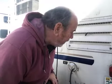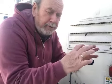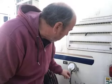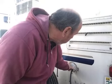This is a little awkward, but the next major, and this really is a major heat loss point, is your electric cord. If you notice when you put your electric cord in, there's a large gap around it. Well, this allows for the ease of putting the cord in and out, but also means on a cold winter night the wind just blows into it. So I took some of my bubble wrap and I've stuffed it in it and I closed it, and this eliminates a big major vent point from the cold outside to inside.